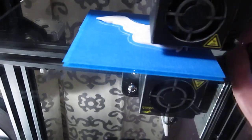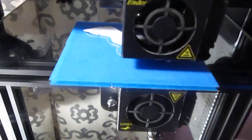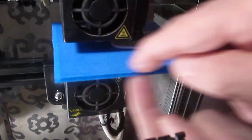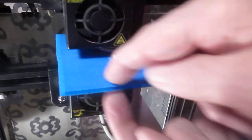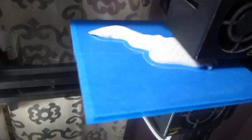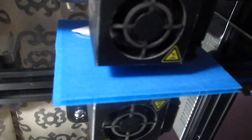As you can see here, you see the skirt — a good skirt means that everything is indeed flat to the nozzle. You want exactly the same distance from the print surface to the nozzle all the way across, all the way up and down, back and forth. So this satisfies my needs, what I'm looking to do. Other means just don't work for me; I guess they work for others, but not me.